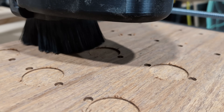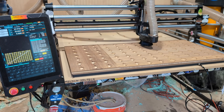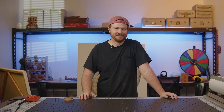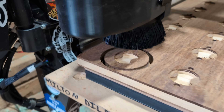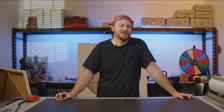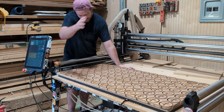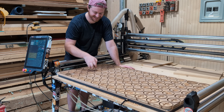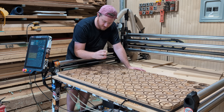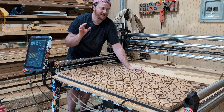It did incredibly well for all the magnet hole positions, the bottle opener insert positions, and the void where the bottle opener actually has to inset so it can work. But then we got to the profile cuts and honestly I was really nervous because it was the first one of 91. When the program was finished I was very interested to see the actual results because I did see three of them actually shift. How cool is that? Now I did have some failures up here — this one does not have any edge damage, this one definitely does, and then this one does not have any edge damage — which means that we just cut out 90 of the 91.